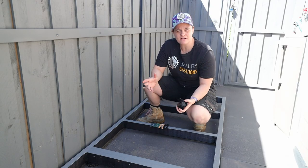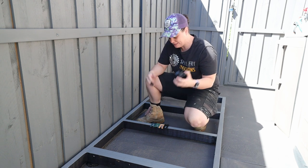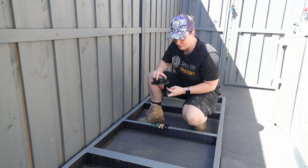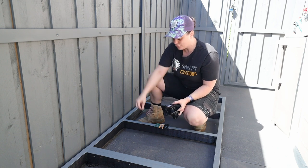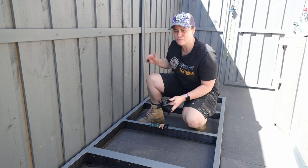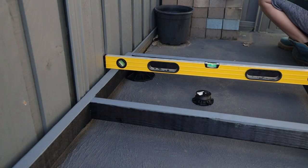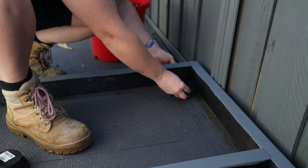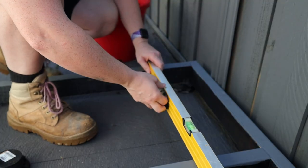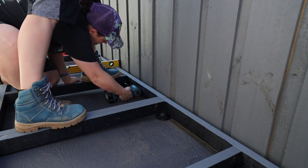We've got the frame out here and been playing around with levels. I picked up adjustable deck leveling feet from Bunnings — they come in different sizes. At the front, the higher side, I'm also going to use some window packers to get that air gap under the deck for water runoff. We started by leveling each end and then made our way into the middle, checking for level along the way. The leveling feet simply attach to the timber with a screw from the side.